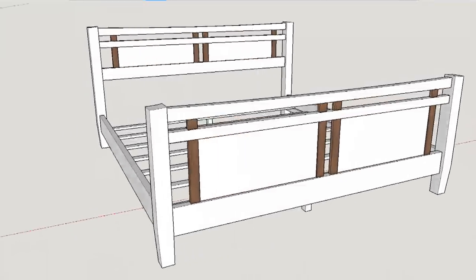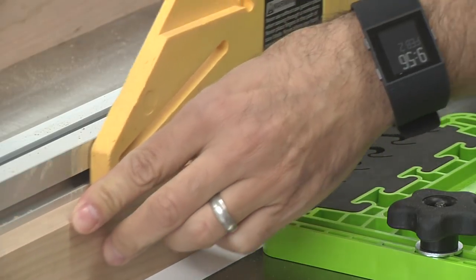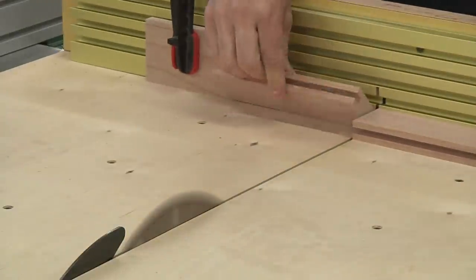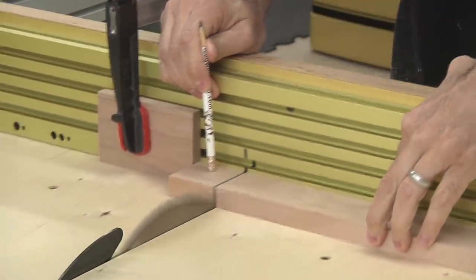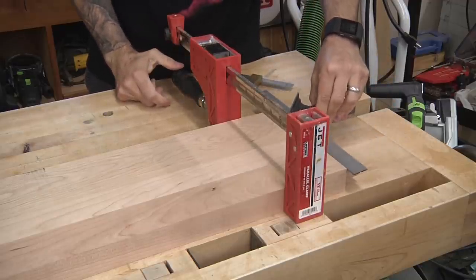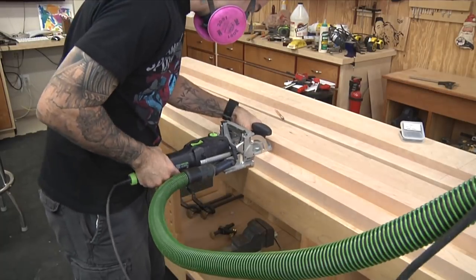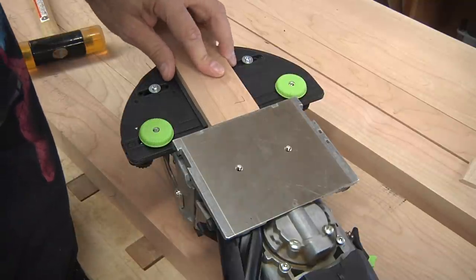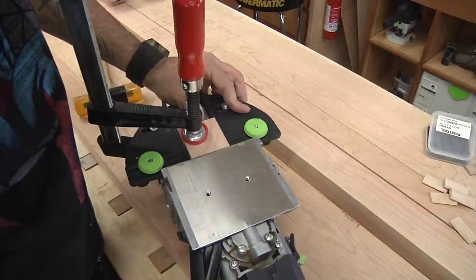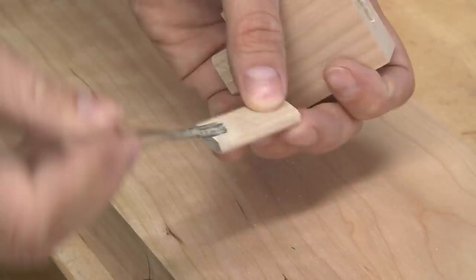Now let's work on the vertical partitions. These are cut to three quarters of an inch in thickness, and some of them will receive grooves for the panels, which are easily cut at the table saw using a feather board for support. To keep the groove centered, I run the piece through twice, flipping it around after the first pass. The pieces are then cut to the appropriate length using a stop block on the cross-cut sled. The smaller top partition pieces are cut here too, using a pencil to keep the piece secure — a trick I learned from the one and only David Marks. With my rails lined up and clamped together, I'll mark center lines wherever a partition exists, giving me a nice reference point for my Domino joinery. I just line up the tool with the center line and we're off to the races. The adjoining mortises in the vertical partitions are cut using the trim stop attachment, which keeps the small work piece safely in position. I find it easiest to do this operation with the tool upside down, and for the smallest pieces a clamp really helps. Just like I did with the larger rail tenons, I'll glue the dominoes in ahead of time.